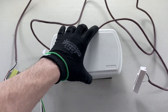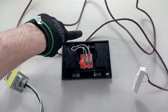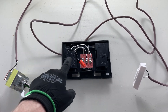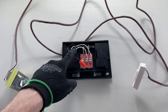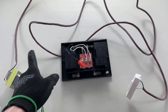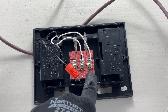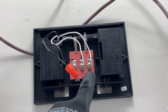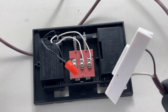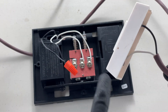Those come into our chime. Inside our chime, I have two cables: the one from our transformer and the other one that goes to our push button. The one from the transformer comes in, and the black from the transformer attaches to the black from our push button. The white from the transformer attaches to the TRANS terminal. And then to the right side, we have the front door. This button will control the front door, and we have the white — which is the other side of our button — attached to the front door terminal.